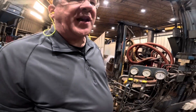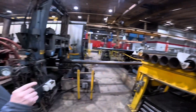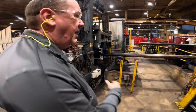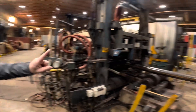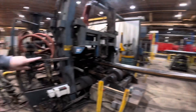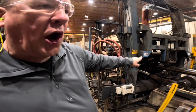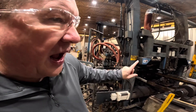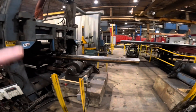If we go over 30 feet the pipe warps a little bit, and we don't want warping in the pipe. You can see these are all the blanks they're working on — all made with the same chemistry. This is our boom pipe chemistry, designed as a high-carbon steel to go through this process. That little tiny wheel leaves a mark on the pipe when we heat treat, so we know when it went through the facility and the date.